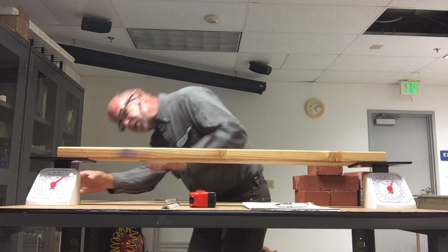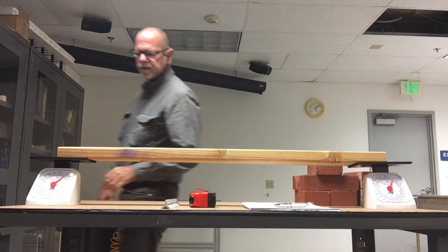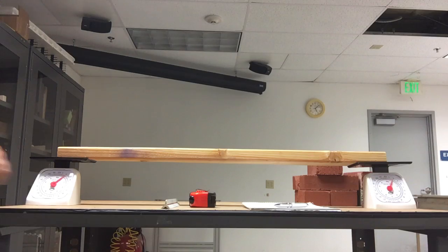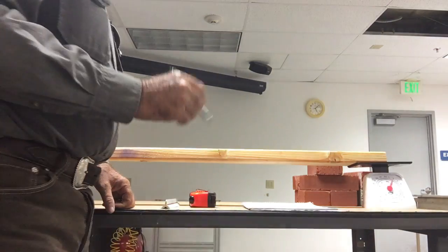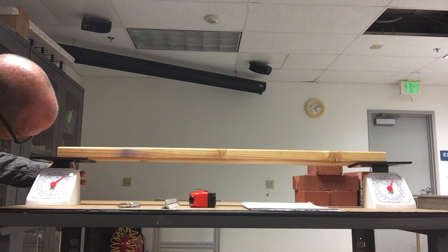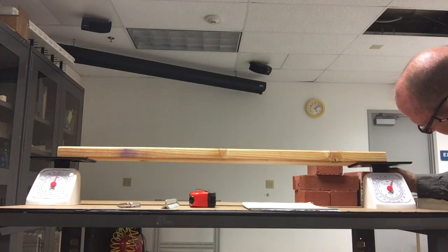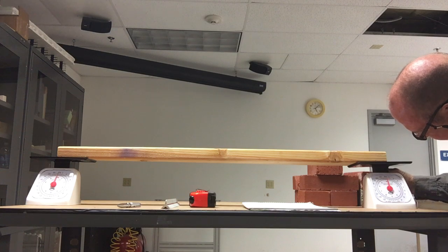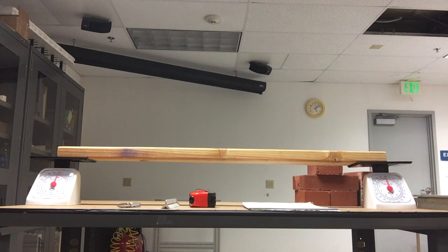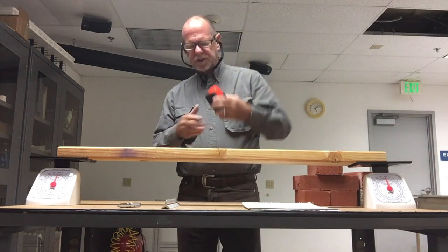And what we're going to want to do is, once we've recorded that, we're going to want to actually sit back now and re-zero our scales. So we come to the very front again and look directly at the center of the dial and re-zero it. We're getting rid of the self-weight of the scale. We'll add that self-weight back in at some other time.